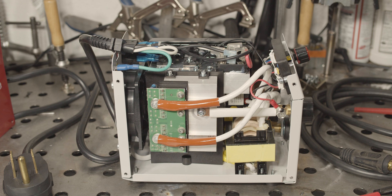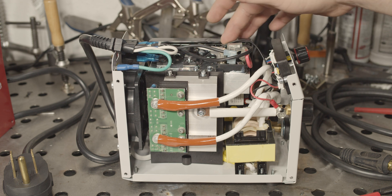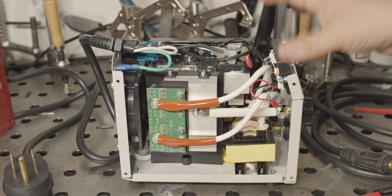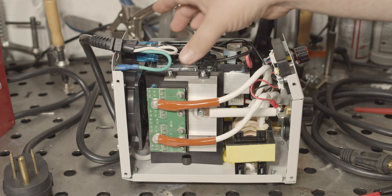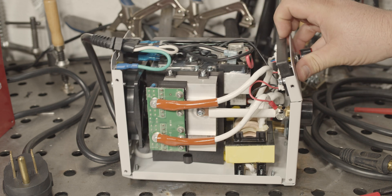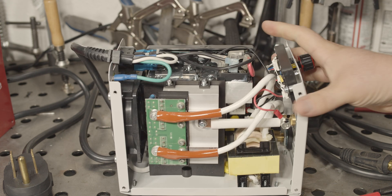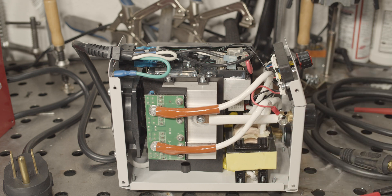The bold amperage claim is one reason I decided to try this welder, but the other reason is that it seems fairly unique. The internal build is quite different from most of the cheap Chinese welders I've looked at. It has fully potted control boards and the overall construction inside is very different from what I'm used to seeing. It doesn't really look like a 220 amp design, but I'm content to be proven wrong, even if I don't expect to be. It has bolted connections, copper conductors, and overall there's really not much to dislike here.